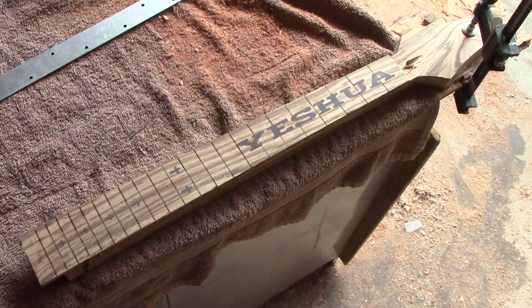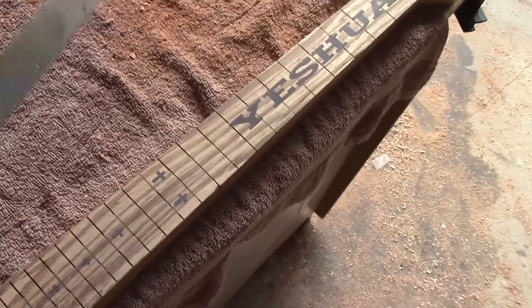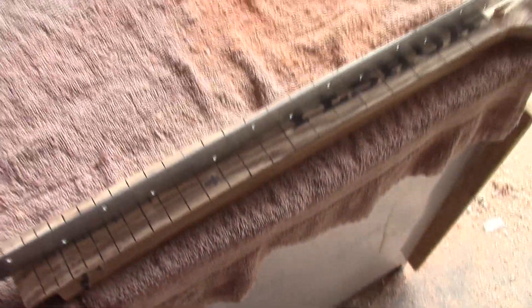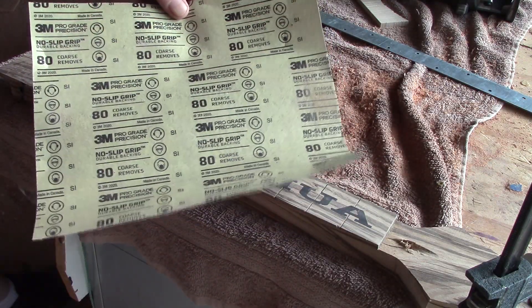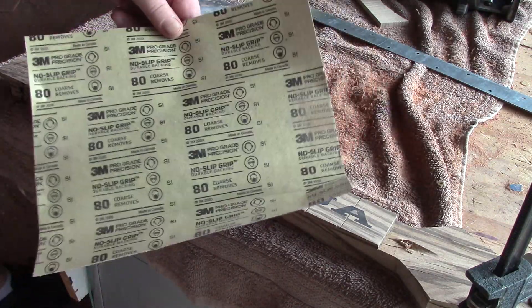For this little venture, a show and tell, this is gonna be our victim right here. I've already made it nice and flat before I even glued it all together. I ran it through the drum sander real quick to clean that top off where I put those inlays in with the epoxy. It also flattens it out perfectly, so we're starting with a good flat specimen. I like to start out with some 80 grit. Some other guys will probably tell you that's a little too rough — whatever, I don't care what they say. This is what I do, this is how I do it.